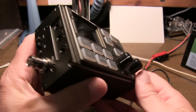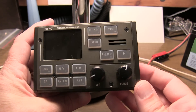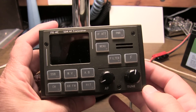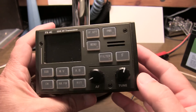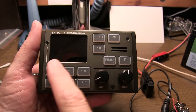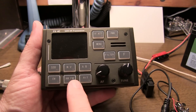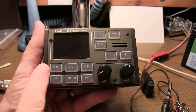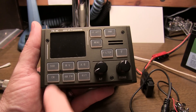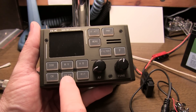Very solid build quality. It's basically designed to operate from 9 volts to 18 volts. It will do up to 10 watts of power. I was getting a little over 5 watts out — actually a little bit higher than that — when running on a 12-volt battery. It features a 2-inch diagonal color LCD display we'll take a closer look at later. The functions on the front panel are very straightforward: upper and lower sideband, CW, memory and VFO mode with 99 memories, and AM and FM wideband receive.